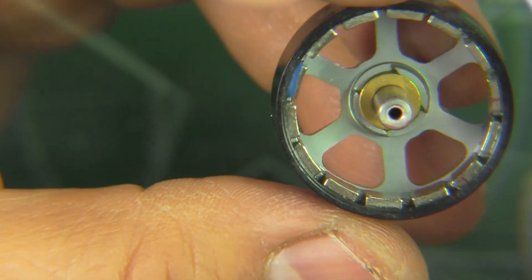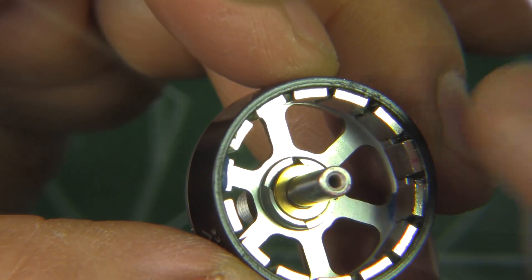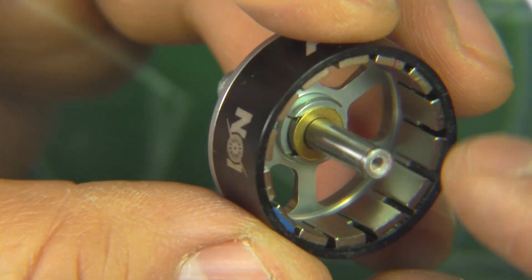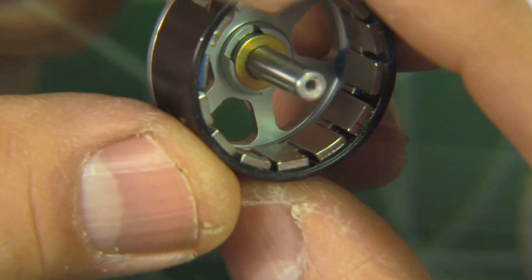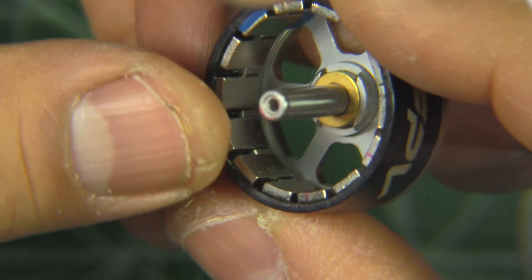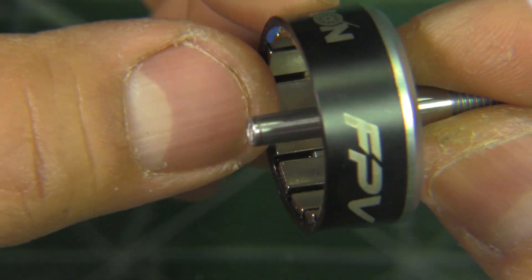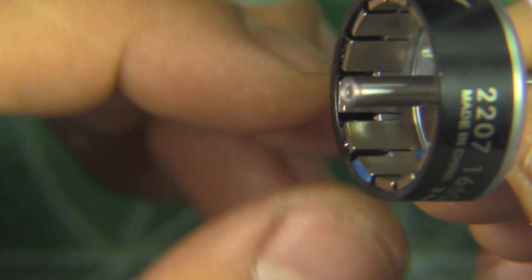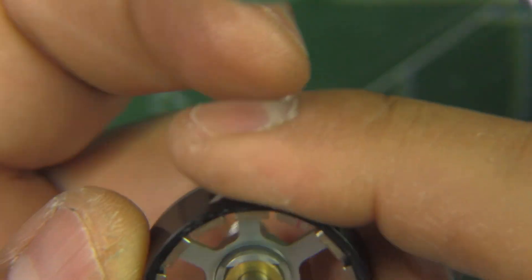In case the motors really overheat, the epoxy might get soft and magnets might slip down — although that's not that common anymore. Every now and then you'll hear stories of magnets slipping down, but with this lip that should help keep them in place. It also adds a little bit of rigidity to the bell and the ring, so that's always good.